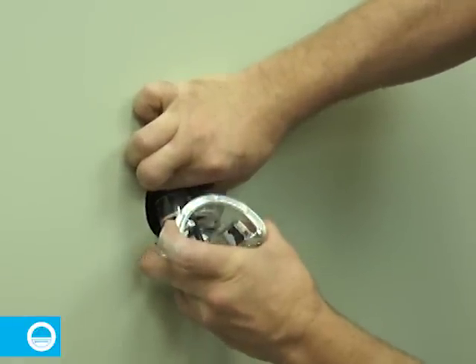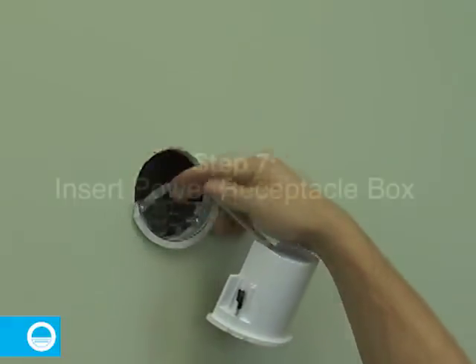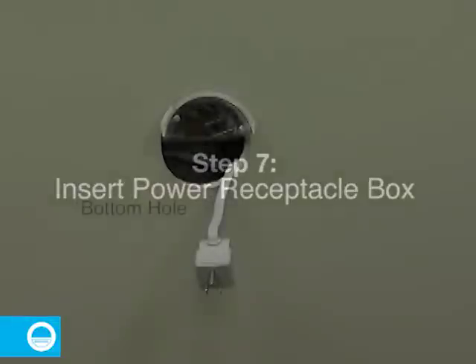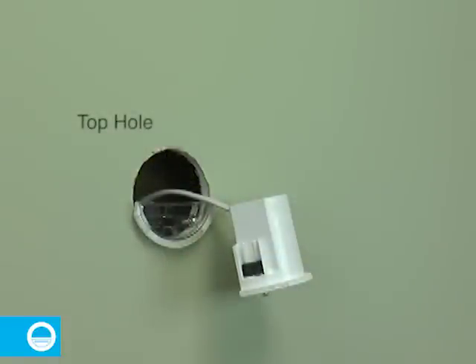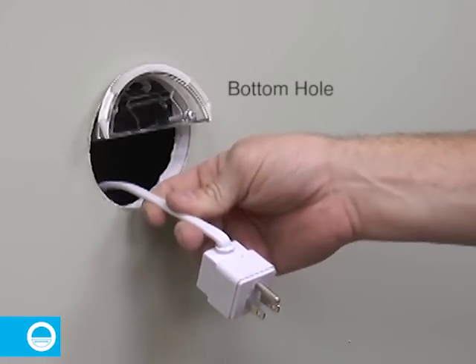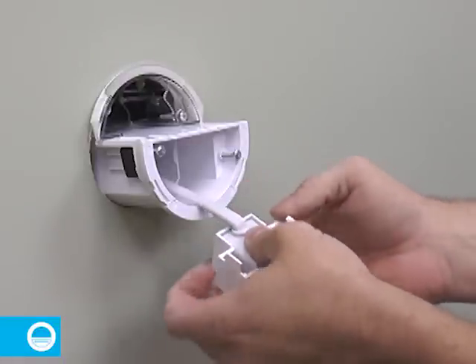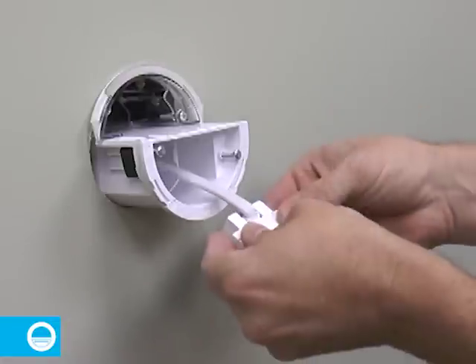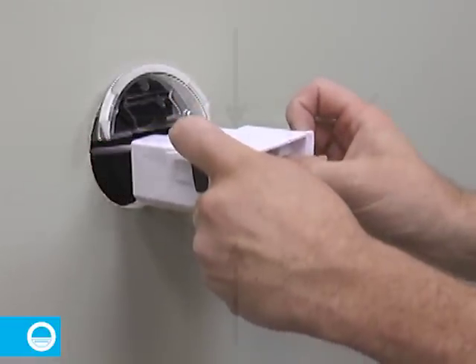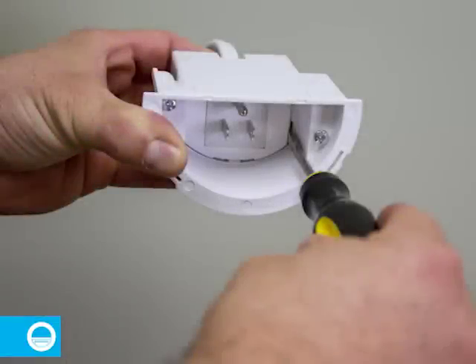Now push the top low voltage box back carefully into the wall cavity so that the tube can be pulled out of the bottom hole — be very careful not to drop the assembly into the wall cavity. Grasp the tube at the bottom hole and push the bottom low voltage box onto the tube, then pull the top low voltage box back into place. Remove the fish stick. Assemble the box insert onto the receptacle end. Gently push the box insert backwards into the box until all four snap features are holding it in place. Note the snap features are intended to permanently retain the box insert, so make sure you are ready for this step.